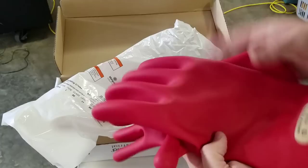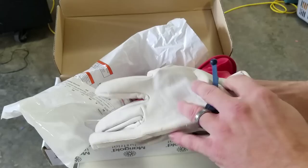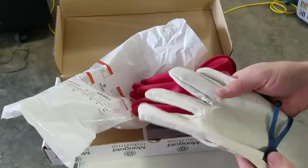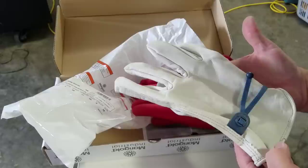What you can do is actually wear these gloves, and then it's recommended to go even further. These were just about a $20 pair of nice leather gloves, and you can actually put these on the outside of the rubber gloves and then you have double protection for your hands. When you're working inside a CRT, if this helps you get over any fear and makes you feel more secure, please go for it. It's always better to be safe than sorry.